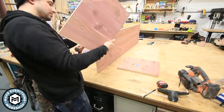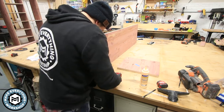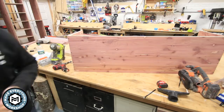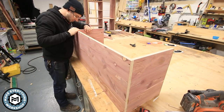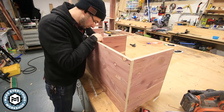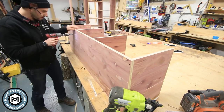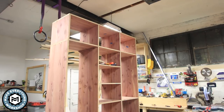There's just one more cabinet section to make, which is the top of the triple cabinet. I did this with glue and screws from the top because you won't see it up against the ceiling - these are also going to get pocket-screwed down into the top of the cabinet, so there's not a huge force factor. The biggest challenge is making sure everything lines up and stays square. I used some brad nails to keep anything from shifting, and you can see how it just lays on top and gets pocket screws driven down into the cabinet.